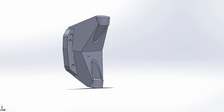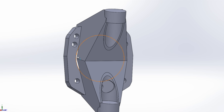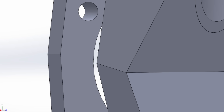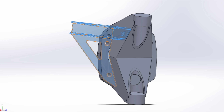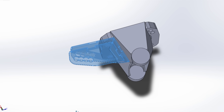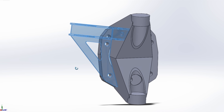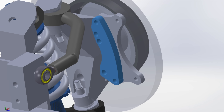This will be made out of welded one-eighth-inch steel sheet metal. The spindle uses just straight pieces of steel connecting the parts, but that's super inefficient. With this box design, you get a more direct load path and it's going to be way stiffer. I have a little gap here — we'll fix that by bending the metal and welding it in. This makes a complete upright, except for the part I need to actually steer the car. I made the steering arm a removable piece so I can change it if it turns out to screw up my steering geometry, and I built it with some adjustability for my steering ratio. The last part is just the caliper mount, which I'm also going to have laser cut — that bolts on so I can change the brakes in the future if I want to.